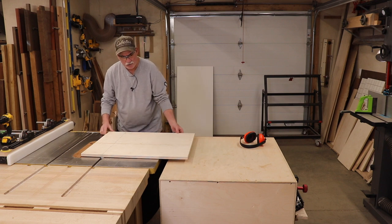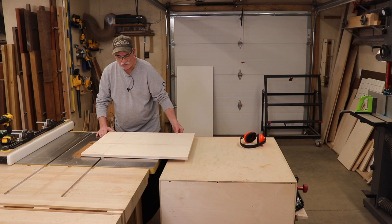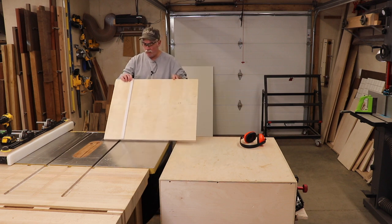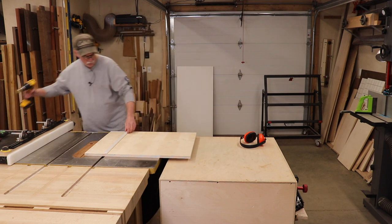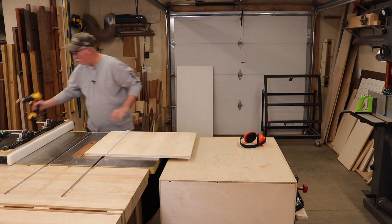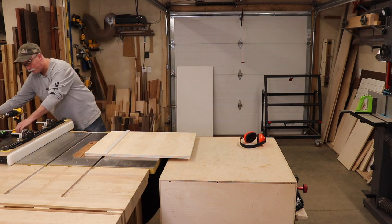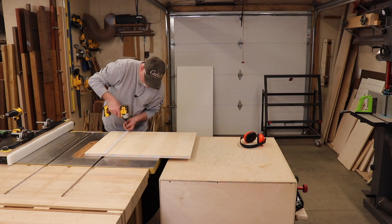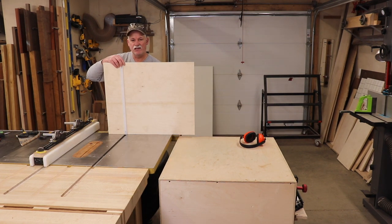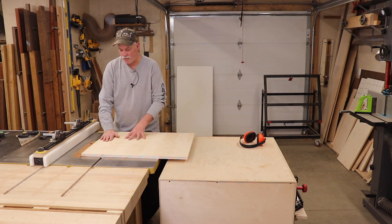With that runner all installed — there's just a little bit of slop in it, and we can take that out simply by mounting some screws in from the bottom side and using them to squeeze out the sides just a little bit. I've tightened up those screws on the bottom to give me a little bit of squeeze-out in that HDPE, and now everything fits with no wiggle. Everything is as it should be and it still slides very nicely.